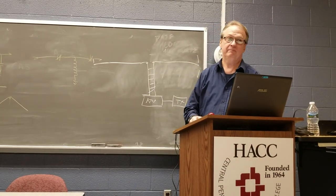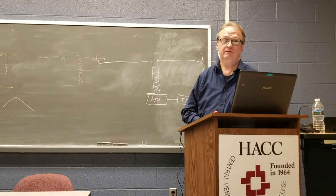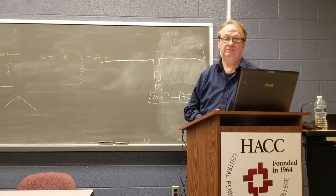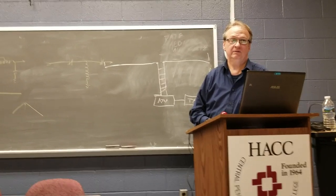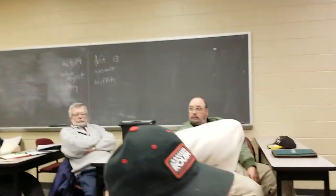One more thing. If you just want to make it cheap and dirty and use coax, I'm sorry, you guys all should know this, but I didn't. If you run 63 feet and 63 feet for 80 meters going north and south, and you run 33 feet and 33 feet going east and west, you put them at the same point. When I teach, I say, when the 80 meters comes up, it sees the 40 meters and says, oh, it's too hard to get out of here, so it all goes down there. You run 40 meters up, it says, 80 meter wires are too long, too hard to get down to 40. You don't need a tuner or a switch. And that also acts as guy wires.